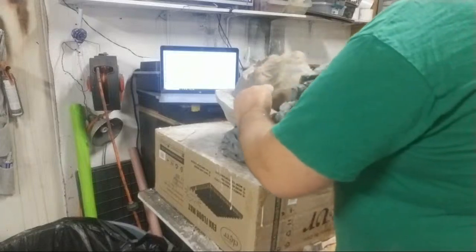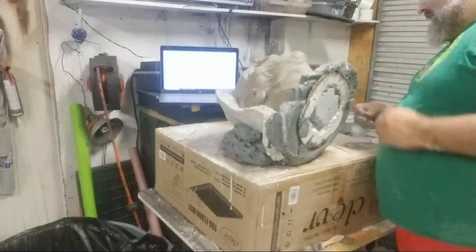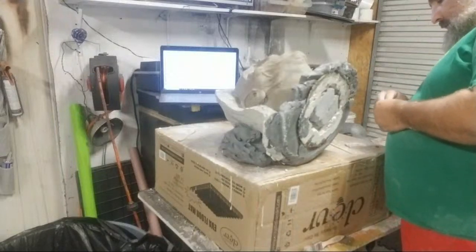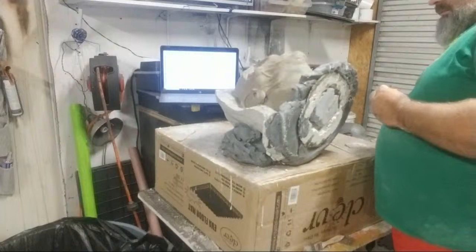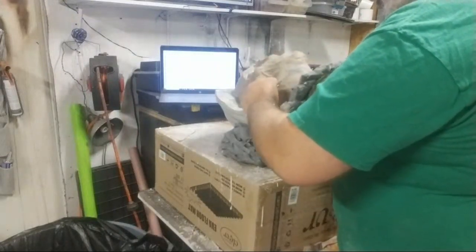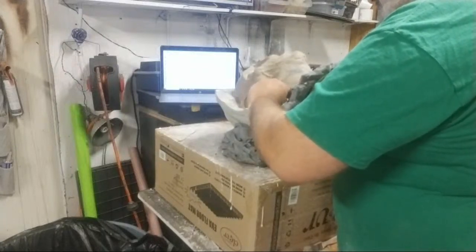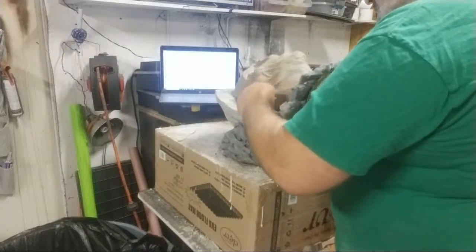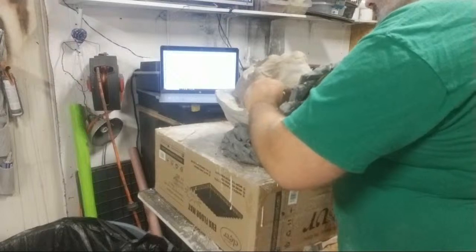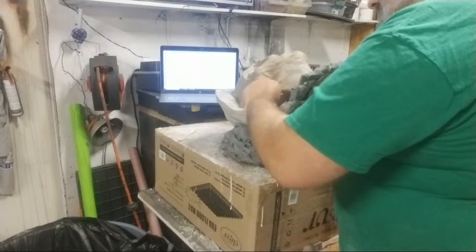This is just where everything was. And I'm hoping that it doesn't explode. A little corner here under the ear, this doesn't affect the look of the mask, but it'd be a very little sharp spot inside of the mold that's prone to breaking off. If it breaks off, I don't know what it will take with it. So I'm making sure it doesn't break off by making sure it doesn't exist.